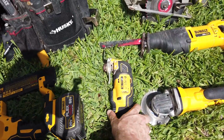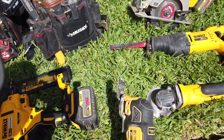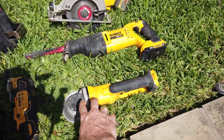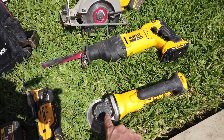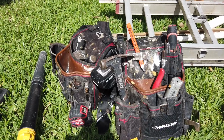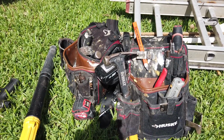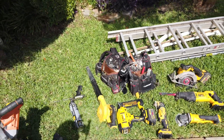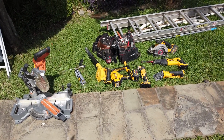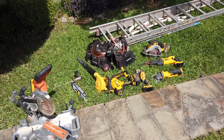And this thing is like a Dremel. It's for cutting baseboards and whatnot. It operates like a Dremel, but you can get it in nice and tight spaces, and it's got this flat piece versus a circular blade, a lot easier to use. And this is a grinder with a diamond tip for cutting tile. And you've got your typical reciprocating saw, typical circular saw, and then your tool belt with your hammer, impact driver, measuring tape, pry bar, utility knife, screwdriver, all the essential items in a tool belt. So that's it for the most part. All the tools that'll need to be used. You can get by with less, but you might need a couple trips to the hardware store. With all this, you can get pretty much every door install done. You shouldn't run into any unforeseen problems that you can't solve with these tools.